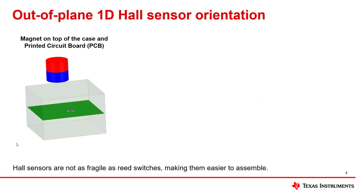Depending on the requirements of an electricity meter, it may not be possible to design the meter to be completely magnetically immune. Due to the susceptibility of meters to magnetic tampering, magnetic sensors are often used in electricity meters to detect external magnetic fields in order to take appropriate action, such as disconnecting services or applying a penalty fee for tampering. This sensing can be done with reed switches or hall sensors. The advantage of hall sensors is that they are not as fragile as reed switches, which may break during assembly.